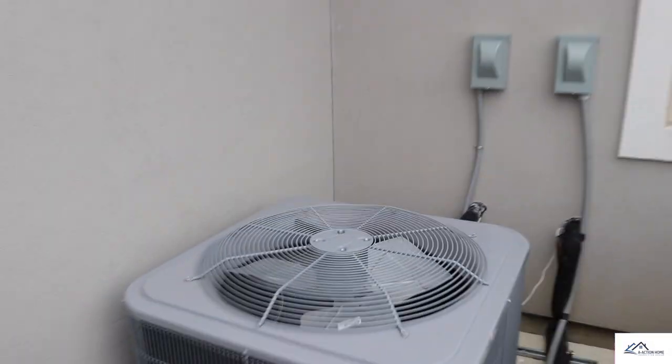Let me show you the last problem. It's actually a really minor one — it's not that big of a deal but it is easily corrected. He has seven condensers outside and they built this huge platform, which is awesome, but they didn't properly put in drainage over here in this corner. Whenever that happens, it's not going to cause any issues right now, but over a long period of time it will actually cause that slab to move. You actually want to add a better drainage system on this slab. You can already see how the soils are even starting to compact in that area.